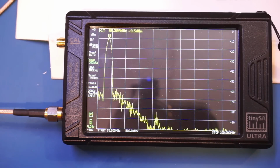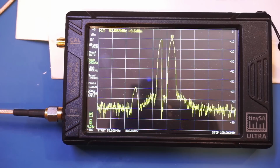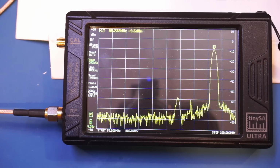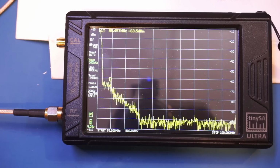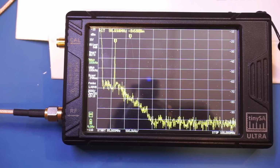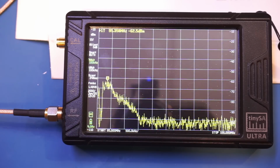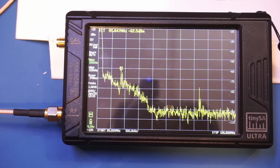To capture time-varying signals, such as the sweep signal, the sweep time of the spectrum analyzer will be very important. And for the tinySA, you will see the limitation here. And there's nothing wrong with that. It's actually somewhat difficult to perform fast sweeps, not just for this tinySA, but for many lower-end SAs in the market as well. This is due to the settling time of the filters during the measurements. Now for the HP8566B, it uses a YIG or yttrium iron garnet tuned filter, which can be tuned very fast electronically, but that is a totally different architecture.